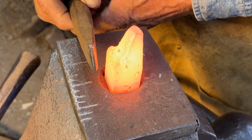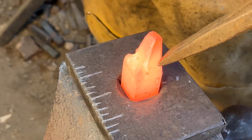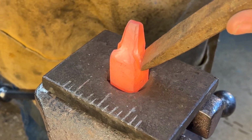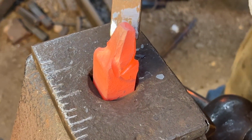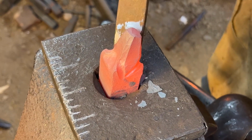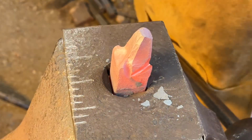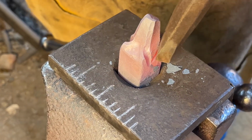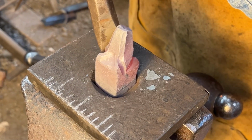This heat, I'm going to be using an 1/8" fuller. I'm going to place it at the bottom corner diagonally. I'm going to come around to the back of the fuller that distinguished the brow from the cheeks. This is going to create a little bit of a beard, or what I call mutton chops, that a wolf has, bottom corners of his face. Once I push that back using a side set, it's approximately a 1/2 inch by 1 inch and about a 10 degrees pitch to it. Drive that material back.